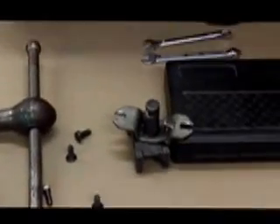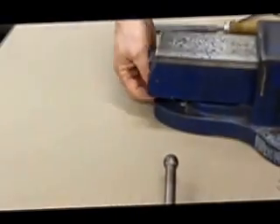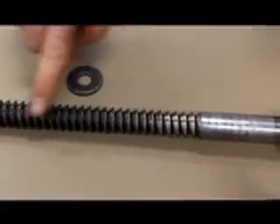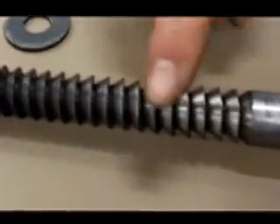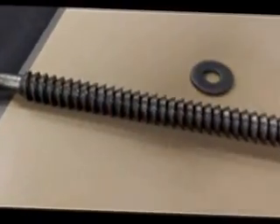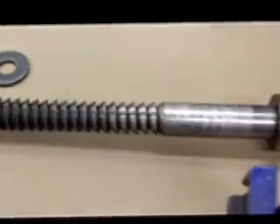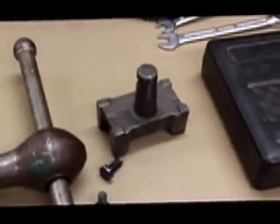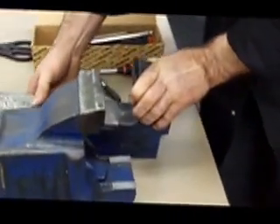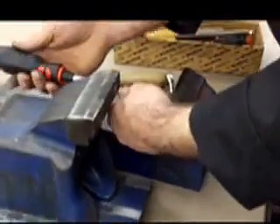Place all parts to one side so you can see them and know exactly how they go back together. Turn the vice back onto its base — remember there's a washer fitting inside that will fit on the end of the shaft when we reassemble it. Notice the different shape on this thread: it's very sharp on one side and tapered on the other, which allows the block to slide and to lock. Now we slide it out and remove the faces of the jaws.